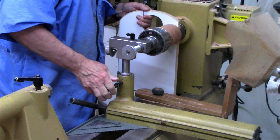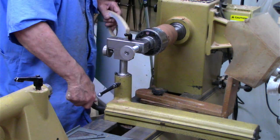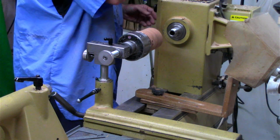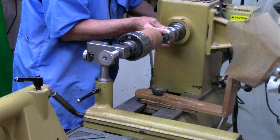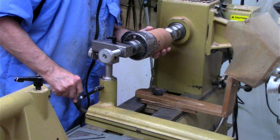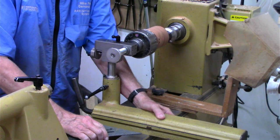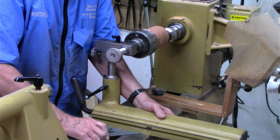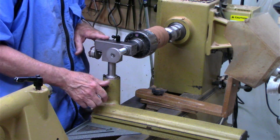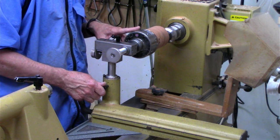Once you get it squared up using the board registration against the spindle, you're going to tighten up the tool post. Now you can shift the banjo out of the way — and you'd think you'd lose your registration, but here's the beauty of it. Put the cutter back on, and all you've got to do is get this lined up properly on the inside for female threads and square up the banjo. By squaring up the banjo again, you put it back in that same orientation because we've kept the board tight and in lockstep with the banjo.